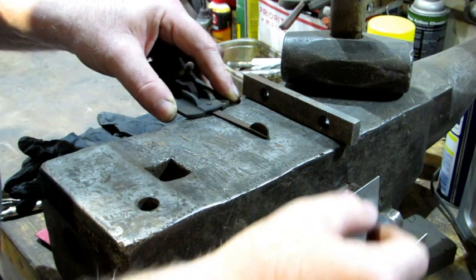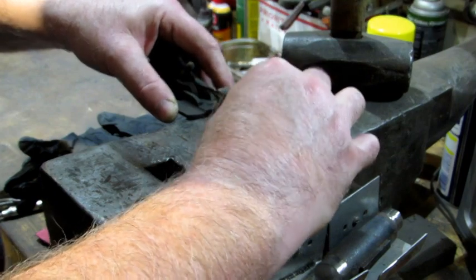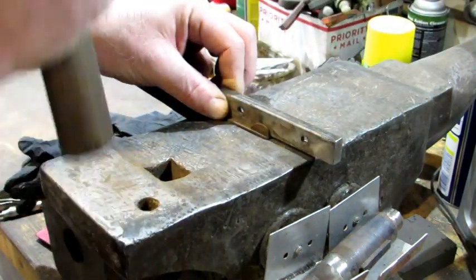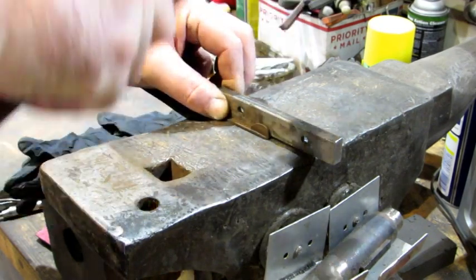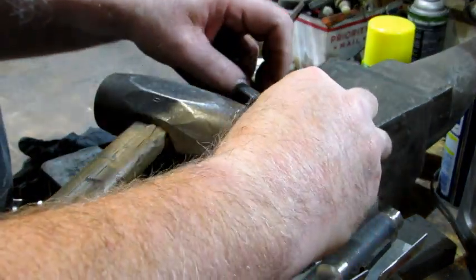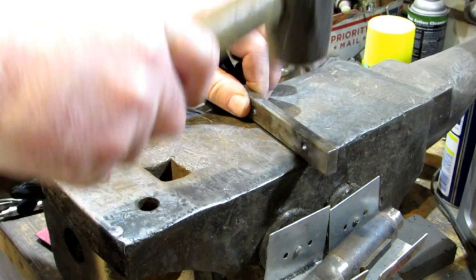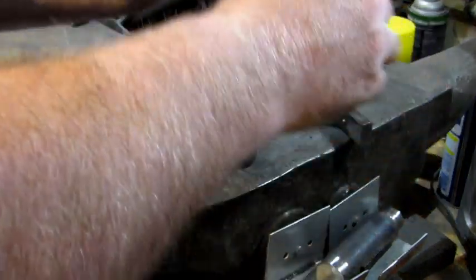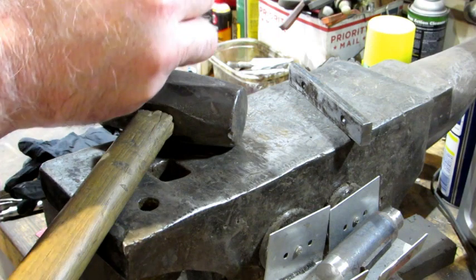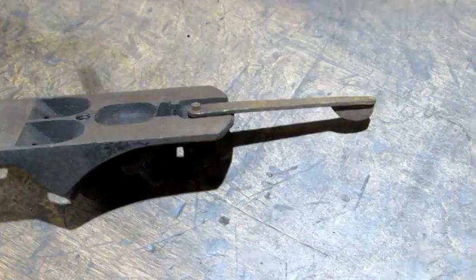You're going to need a hard metal surface of some sort, and you're going to need another flat straight piece of metal like what I'm using right here — it's one of my old jaw faces. I'm lining that up on top of the lateral, right up against that little protrusion that comes out the bottom, with a nice heavy hammer — this one's about three pounds — and giving it a firm whack on one side, then getting it flat on the lateral and doing the opposite side. A couple more firm whacks, eyeball it, and that's pretty darn good to the eyeball — that one's good enough.